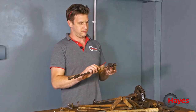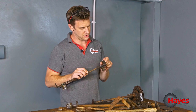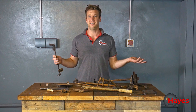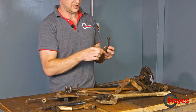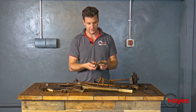We've got other bits here, all needing cleaning up. This is the brake bit — it's got a little brake pad on the end there which looks a bit mushed. So we're going to see what we can do with that — whether we just layer up some nice dishes of leather, or try to get some leather from somewhere, or maybe take my belt off and use that. There's another bit of leather on the brake bit which goes around the clutchy bit on the gearbox. That brake comes down and grips it, so that needs a new bit of leather there. Someone's replaced it once before with a few rivets — we'll do the same but with a nice new bit.